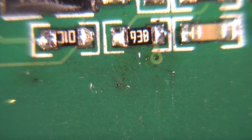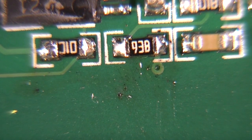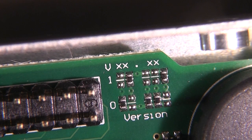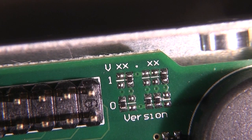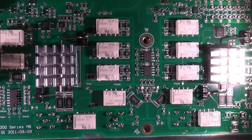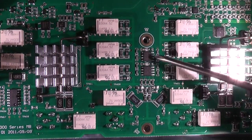Literally about the only thing I can find on this board that shows any trace of being a mod is a little bit of flux around these two resistors, so they may have been replaced with a different value or reworked from a poor reflow. There are some resistors marked 'version' — I'd be interested to know whether these are machine readable, because you do occasionally find resistors being used as version markers on boards. Also, there are two different lengths of screw used to hold this board and the front chassis together, and they actually mark on the board with a little picture of a screw to tell you which ones are the long and short screws when you put it back together — very nice of them.